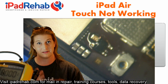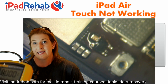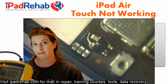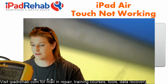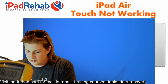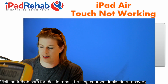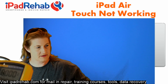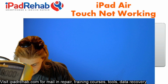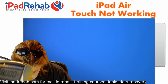So I'm glad that we didn't spend a whole lot of time troubleshooting that chip and the enable and what can we do to make the chip make its output, because there's probably a reason why that voltage is not coming out of the PMIC. The only thing I want to do is make sure that our test was good. So I'm going to lift the battery, plug it back in, and boot it up again with a screen attached the whole time, because I'm just not 100% sure that that answer is a good answer.